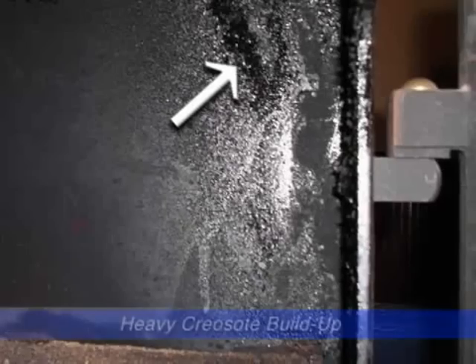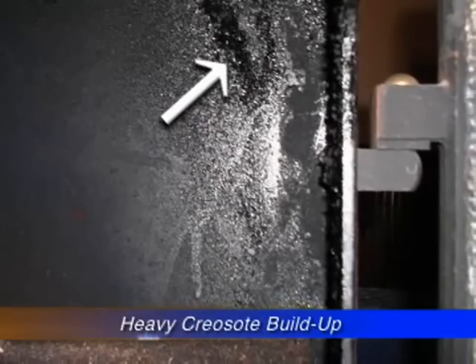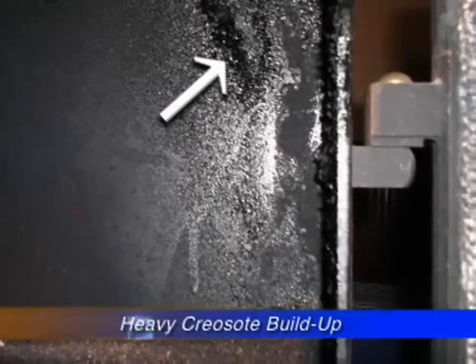Let's go to the next issue — a dirty chimney. Let's say everything's fine with the chimney but it's filthy. Should a home inspector recommend that a chimney be cleaned? Certainly. Anytime you look at a system that's been used a lot and you start seeing creosote buildup, creosote can catch fire, which will lead to a chimney fire, which would then damage the chimney system. In metal systems, a chimney fire can damage it enough to require replacing the entire system, and terracotta flue liners will crack. If you see a decent buildup of creosote, you certainly want to call to have it cleaned and further inspected. Thanks for being on the show, Mike. My pleasure — we'll see you next time.